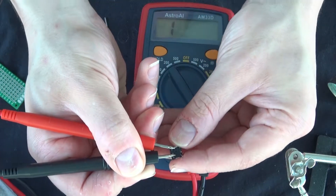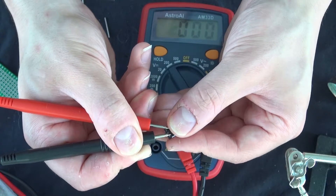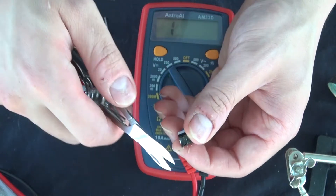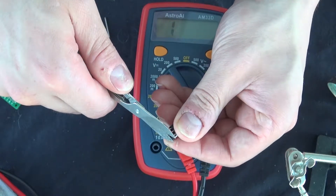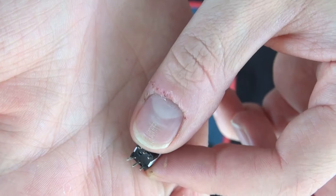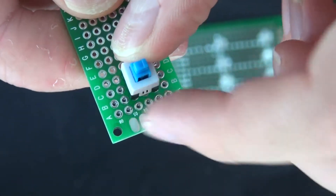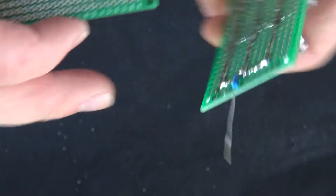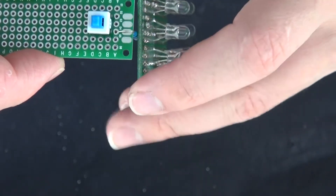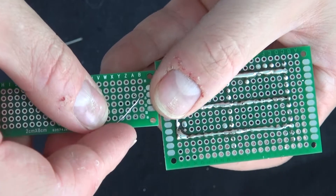Now I'm going to check this switch to see which pins are connected. Those two pins are the correct ones — the rest need to be cut off. Those two pins on the top left are the ones to keep; snip off the rest because they're not needed. That's how you tell which pin is which for turning the circuit on and off. This is basically a double pole double throw switch. The board with LEDs on the right — please ignore that, it was the first one I made and it was a complete error. Focus only on the board on the left, and that's mostly about the switches.